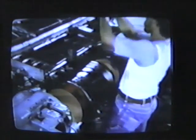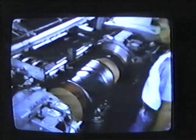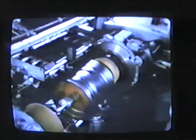He applies a permanent carcass identification label and his builder's number. Automatic rollers stitch the entire carcass together, completing the first stage assembly of the radial tire. The uncured carcasses are stored on end to prevent distortion of their circular shape, and they are conveyed to second stage assembly by a driverless robot tractor.